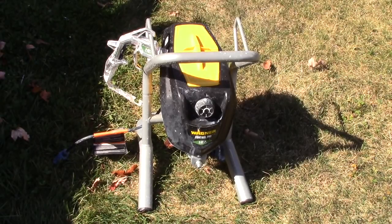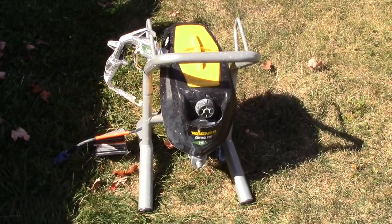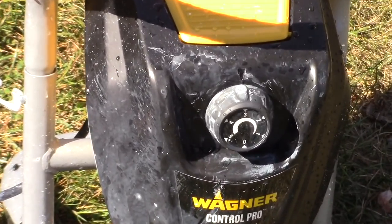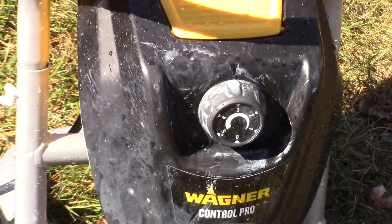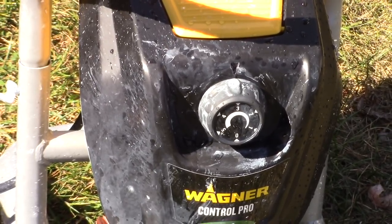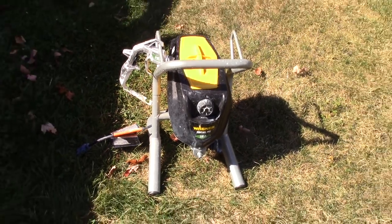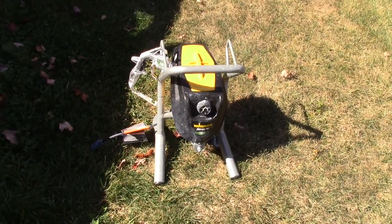This sprayer is light, versatile, strong, and quiet. Easy to move and does not take up a lot of space. There's really nothing I can say I dislike. As far as cleaning goes, it's not that bad - take the discharge hose, put it in an empty waste bucket, run clean water or warm soapy water through the unit a few times and it'll clean right out. You can use it over and over again.